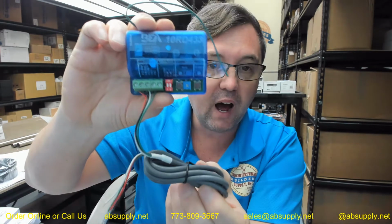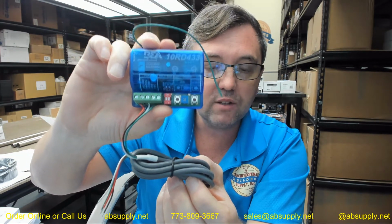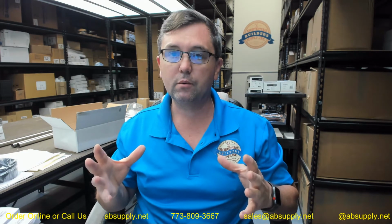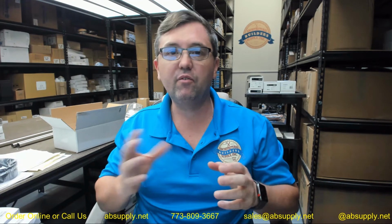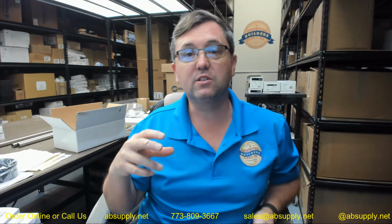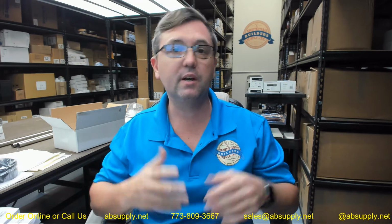And all of the work in setting everything up is literally done on the receiver. Now, BEA does have their 10 BR3, which is going to give you much greater capability because it possesses internal relays and far more functionality. Outrageously capable. If you need to have the ability to trigger something to happen where a relay is actually required because of the electrical characteristics of what you're trying to manipulate, then the 10 BR3 is probably what you need.